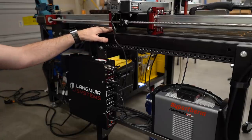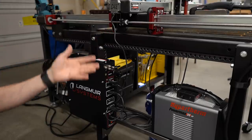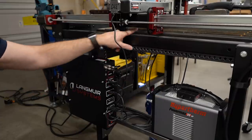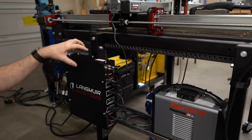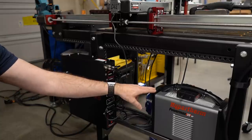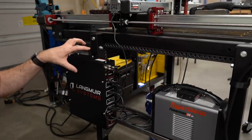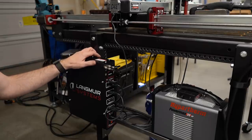The reason that matters is because the tray, the slats, and in fact the whole frame of the plasma table is a part of the plasma cutter circuit. The ground, or the work clamp — which is actually the positive side — from the plasma table connects to the underside of the tray that contains the slats. So if you have an electrical connection between this box and the frame of the table, it will interfere with the electronics, because the actual cutting current flowing from the plasma cutter will then be connected — at least the positive side — to the electronics ground. They've gone to great lengths to keep that separate.